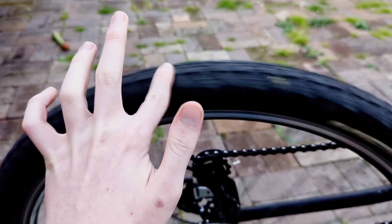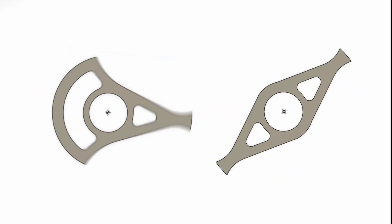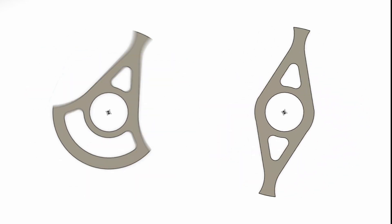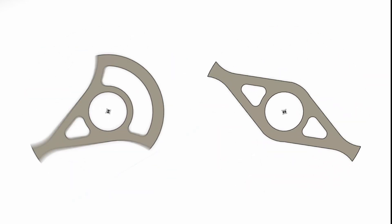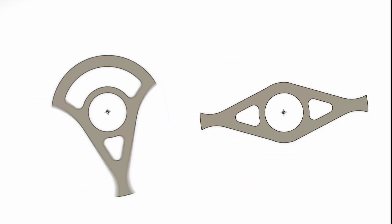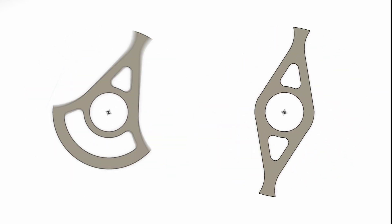Compared to jamming your hand into the spokes, which will most probably stop it from spinning — it's also going to hurt a bunch. Having fewer teeth allows for more of your opponent to travel into your weapon radius per revolution, leading to more engagement. Or as you can see, a bar with half as many impactors can spin twice as fast for the same rate of teeth passing by.